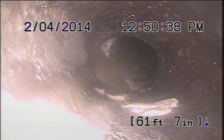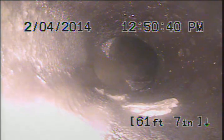So, lots of work needs to be done to the side sewer. I would recommend a pipe bursting rather than a trench digging. That's where we hydraulically pull a bullet through it. Since I can get a camera through it, we can get a bullet through it. Yeah. Hydraulically pull a bullet through it, pull an HDPE back into its place. And then exposing this section, and any tie-ins, and pull the pipes in between all those sections. That's where it would lead me. So replace all the way from the tie-ins? Sadly, yeah. Okay. Camera's bad news sometimes.